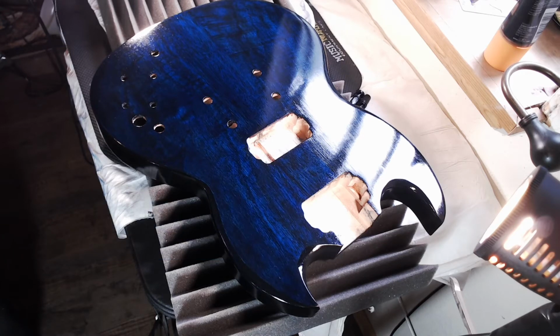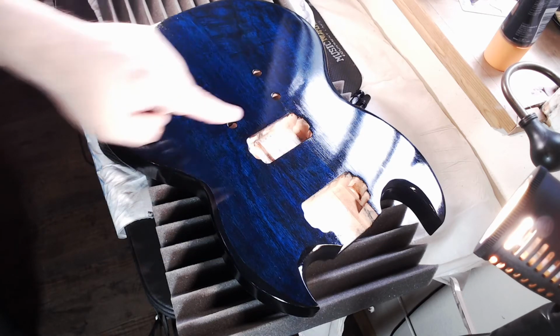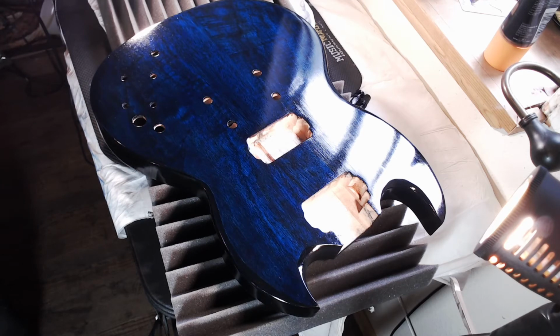As you can see, there's definitely some orange peel effect, where you can actually see the texture of the wood. Part of that's because I didn't pore fill the wood, which would have given it a much smoother look. But also the streaks from applying the Tru-Oil cause those lines. And most of that will come out when this is fully cured, and I can Scotch-Brite it very lightly, and give it one last shine, maybe even buff it a little bit.